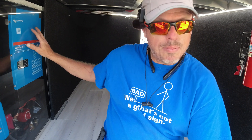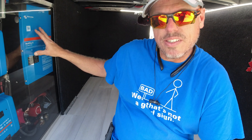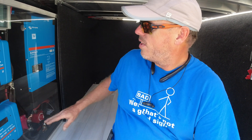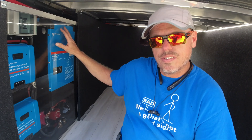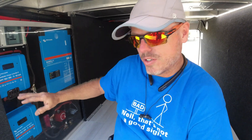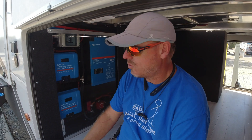But it operates the same. Slight differences: it's only five and a half, almost six inches deep and about the same width, but it's 22 to 23 inches long, which is kind of a game changer as far as being different. It does change things a lot because the Multi-1 is like eight and a half inches deep. So if you're trying to do a nice pretty wall and have everything kind of the same depth, it is a little more challenging because you have to recess the multi so much deeper in.